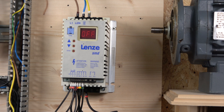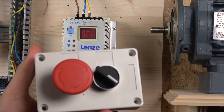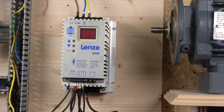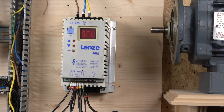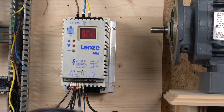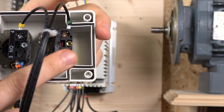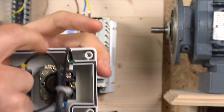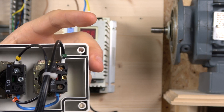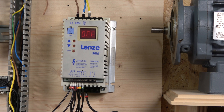Now that the wiring is done, let's talk about how it's all set up. We've done things a little differently from the previous video because this time I'm using an e-stop. Rather than just stopping power going to terminal 28, I'll send a request to the drive to quickly stop. A normally open contact at terminal 20 sends power to a normally open contact on the selector switch, which sends power to terminal 28. The normally closed contact goes back to terminal E1, which we're programming to do a quick stop.